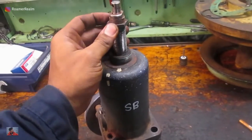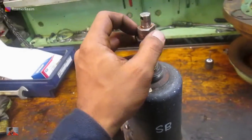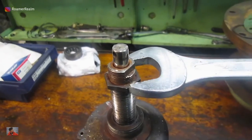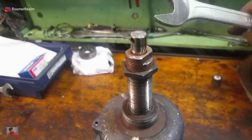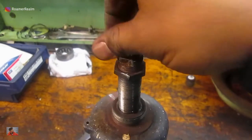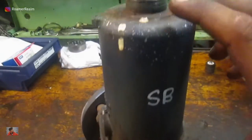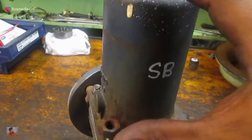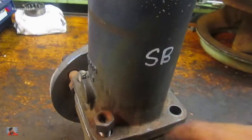The first thing was the locking nut — this is size 27 on this safety valve. The locking nut had to be removed, and then the inner nut is size 17. You release it gradually until it's totally out, which decompresses the spring and lets it expand.